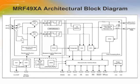The transmitter with a direct conversion architecture has a typical output of plus 7 dBm. An internal transmit-receive switch combines the transmitter and receiver circuits into differential RFP and RFN pins.